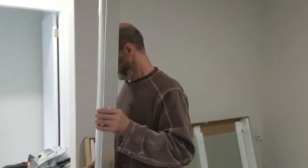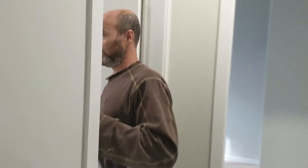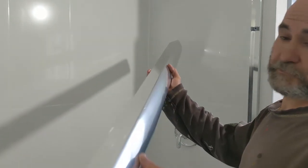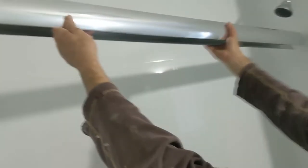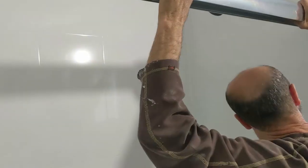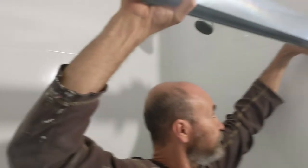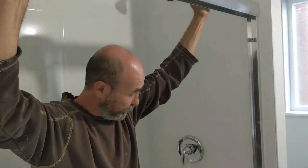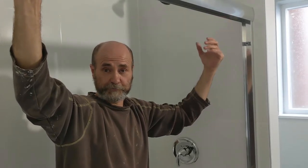Next step is the top track. All we do — you just take it and slide it up there, not hitting the tiles. I cut it a little bit smaller than the space I have here, that way it fits good and doesn't scratch the tile. So I just go with it like that, as close to the track as possible. You guys can see how it fits right there. Then I fit the other side the same way, and that's about it. Now we're gonna work on the door — set up the door to put in here. I'm gonna fit the inside door first, the one that goes on the inside, that way it's a little bit easier.